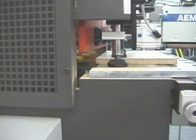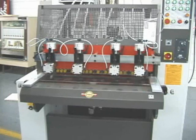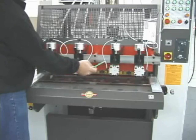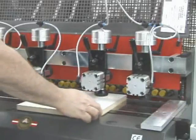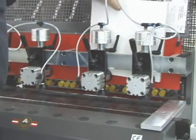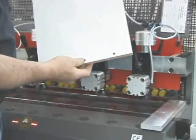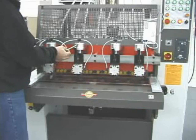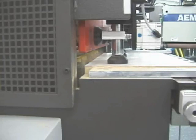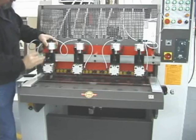This Elite is equipped with optional bi-directional hold-down clamps. The horizontal clamps can hold small parts in a vertical position against the clamping fence, which is useful for drilling small parts such as drawer parts. The vertical clamps clamp parts to the working table surface for drilling, gluing, and inserting of dowels and other end boring functions. The clamps easily adjust across the clamp frame to accommodate any size workpiece.